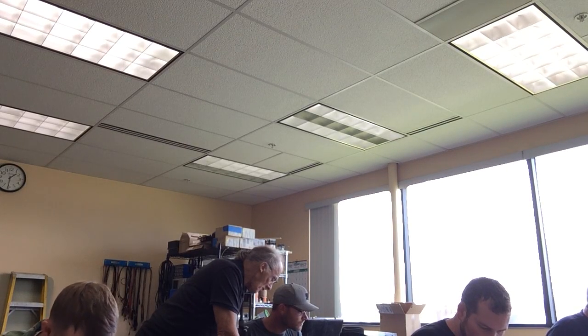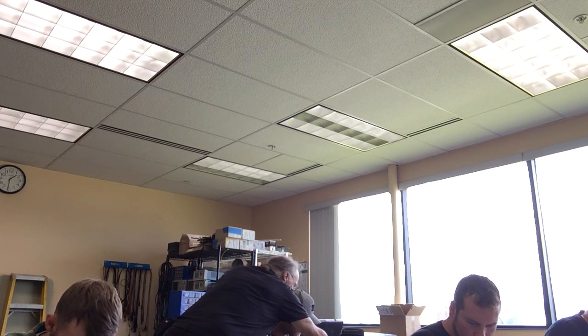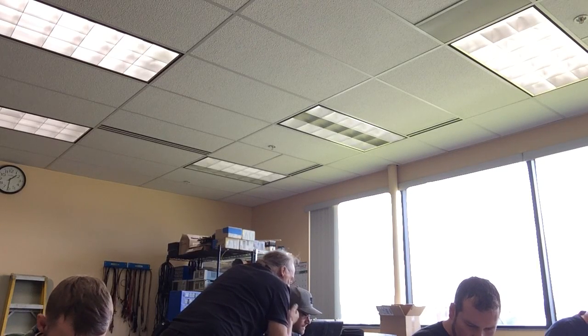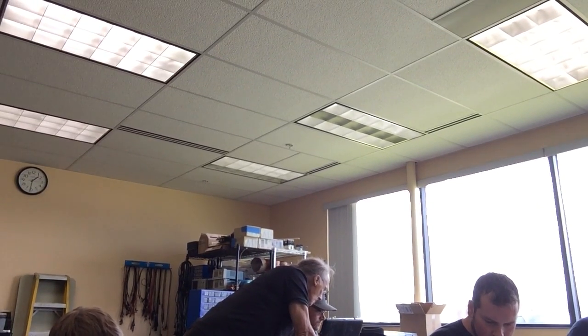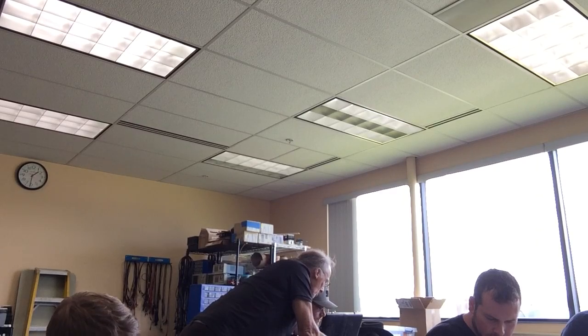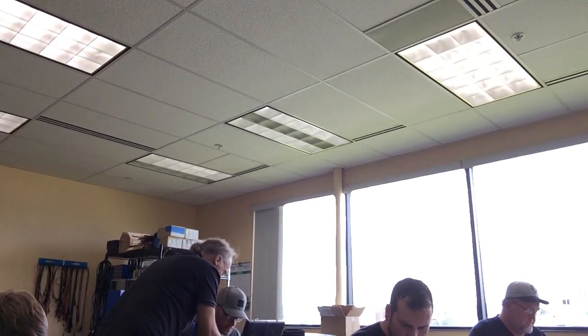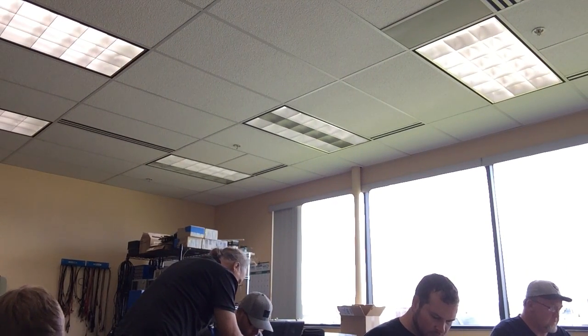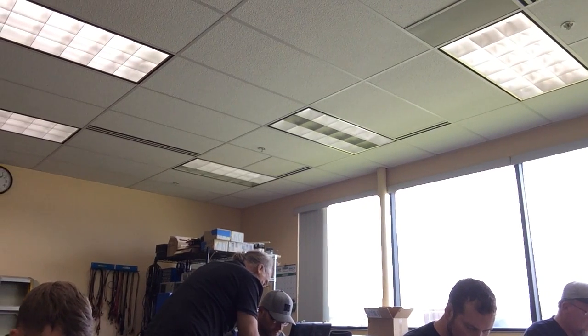Okay. Don't see any current there. Everything's connected, and your battery looks like it's a problem here. Yeah, you got a battery issue. All right, so you're not going to get the current. Now, if you want to do resistance, then you're going to have to go to there. 20K. There you go. Actually, 2K. Now you should be able to get them. Oh, okay, that's the resistance. Gotcha. Otherwise, you're measuring across the battery again. Okay. Very good.